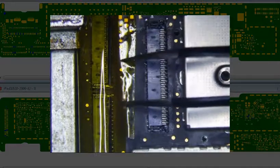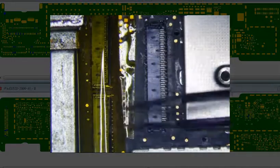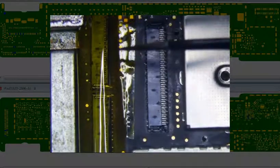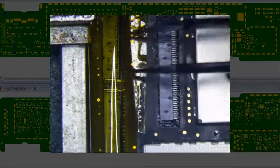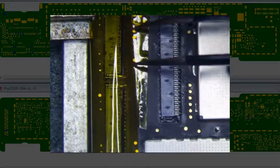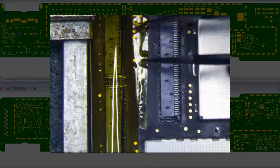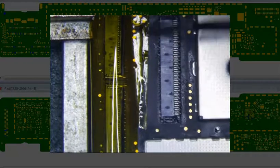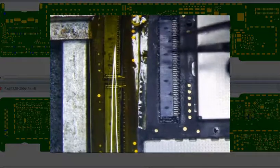So this time I'm going to change things up a little bit, and I put some 1-inch Kapton tape over both connectors, and I made sure I flipped the tabs up because when I have them down here they seem to burn a little easier. So I flipped them up this time, and I put 1 inch here, and then I also put probably a 1/4 inch Kapton tape and taped it down here so the air doesn't get under there.